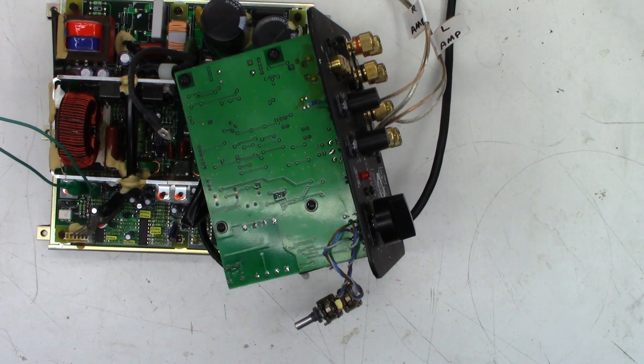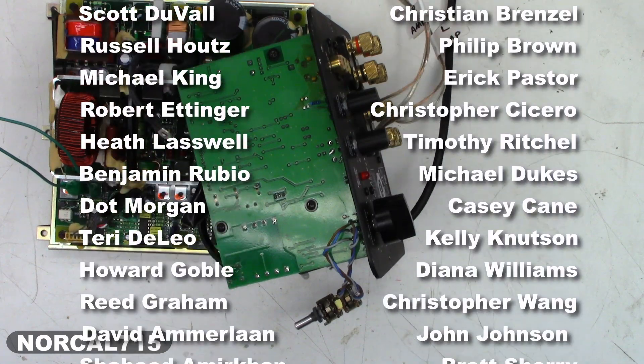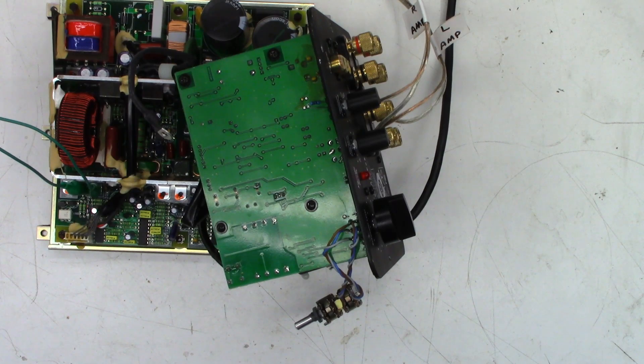It's going to need a couple of pots, and I'm going to have a problem finding the value of this one. But this is just the initial diagnostic, the troubleshooting stage. So if you've got a SuperCube 3 with no audio, check the resistance of all three pots and see what you get. The main amp is working correctly. The customer might just want me to leave the pot loose in there so he can adjust it and then set his subwoofer level on his receiver as he sees fit. This is the Definitive Technology SuperCube 3 subwoofer - supposedly rated at about 650 watts RMS. Go ahead and leave a comment, hit that subscribe button and like this video. You can follow me on social media or email me at NorCal715. With your help we can try to keep these things out of the landfill. Thank you so much for watching.